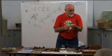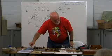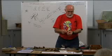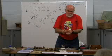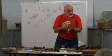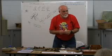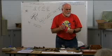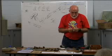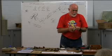But the point is that you've got to sharpen all that metal. That's a lot of metal to have to sharpen up, whereas my technique of cutting away the shoulder leaves you with a much smaller footprint on the cutting face, so it's a lot easier and quicker to sharpen. So there's no real advantage having the light shoulder, as most woodworkers would normally. I didn't see any advantage in just leaving the tool like that. I'm just wondering why they did it in the first place.